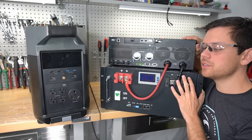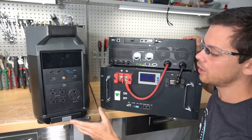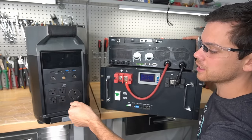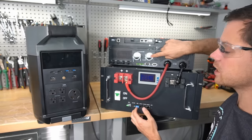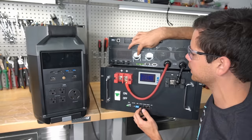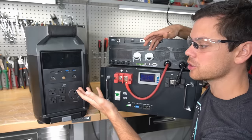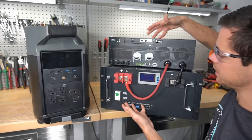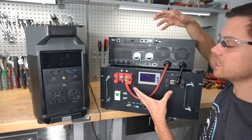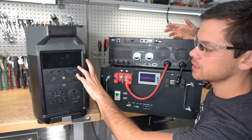Now let's talk about the downsides of a DIY system. First off it is not as beginner friendly. On the Delta Pro you have outlets and USB ports — you just plug stuff in. With this one you actually have to connect your loads to a terminal block and connect your own cable to the AC input. Also the Delta Pro has wheels so you can move it around — it's 100 pounds but easier to move. You could put wheels on this, and I've seen people put these on hand trucks for a mobile system, but it's not going to be as compact as the Delta Pro.